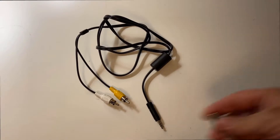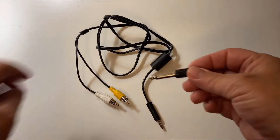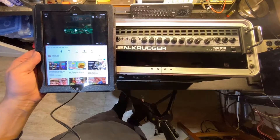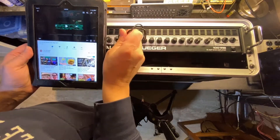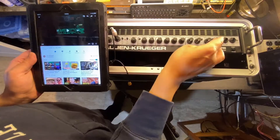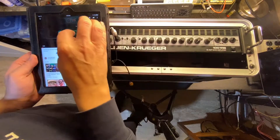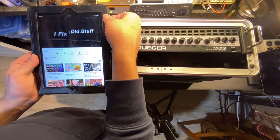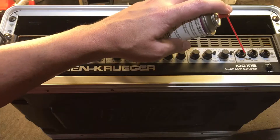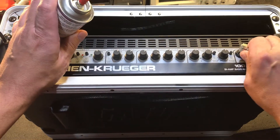I'm going to show you three different ways to create the harnesses we need, depending on the parts you have available. The easiest way is to use one of these 1/8 inch to two RCA cables, then attach an RCA to 1/4 inch mono adapter to one of the RCA ends. Always start with the volume on your device and amplifier under test at zero. Plug this into your amplifier and bring up the volume. Put on your favorite YouTube channel — the one you are on now is an excellent choice. Then slowly bring up the volume on your device. Now you have a steady signal stream and you can begin to troubleshoot or test. If you've ever tried to play an instrument through an amp and troubleshoot at the same time, I think you'll find this method much easier.